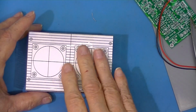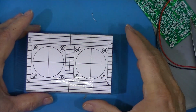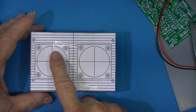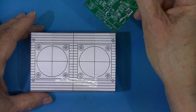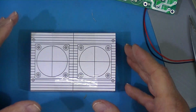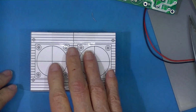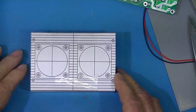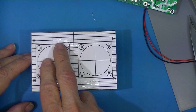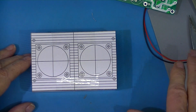Now, the thing about using a template is that you can make a drawing in some sort of drawing program, assuming you can do it to scale, get all the dimensions off the fans and whatnot, even off the printed circuit board documentation for these holes, which you could do just by putting some layout die on here and scribing. But if you want to change things, try to see how things fit. You can move them around in a drawing program. If you need to make 10 fans, you just draw one and then plop it down and so forth.